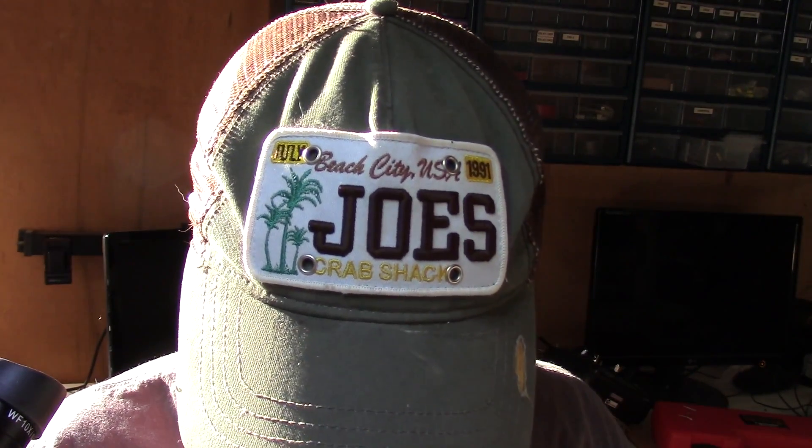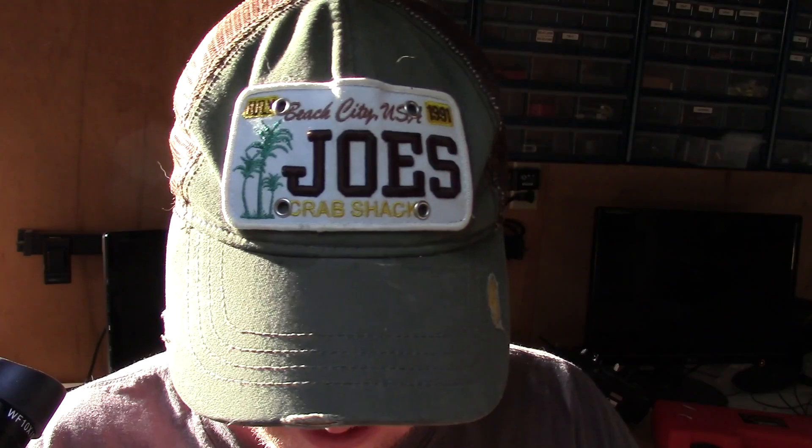We're out in the shop today. I had another Wouxun radio given to me that someone was going to throw away. It looks like it's been submerged. I wanted to go over how you'd repair one of these Wouxun radios - how they actually come apart. There's really only one major item: an area you have to desolder to get the lower board off. You only have to take it off if you need to replace something major. If you change out any of the main RF ICs, you'll want to remove this board, otherwise all the heat will soak into the heat sink and it'll be really difficult to solder.